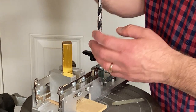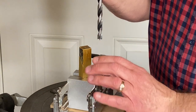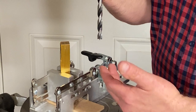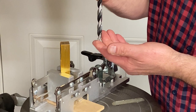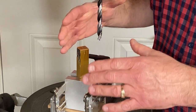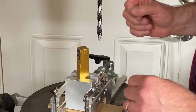I ended up taking a toothbrush and some acetone and scrubbing the bit to get it off, because I didn't want to change the diameter of the bit by having all that cake to the outside of it. It really sticks to the bit. I'm guessing it's the PMMA or whatever the resin is used to make the mold - when it gets hot, and the bit obviously gets hot when it drills, it gets sticky and sticks to my bit. So we're going to keep an eye on that because I don't want to burnish the inside of my blank and make the holes larger than they need to be, because then my tubes are not going to fit nicely in the blank.